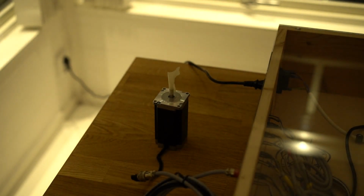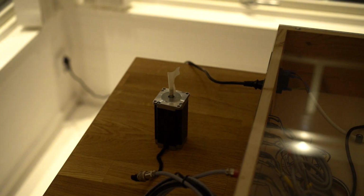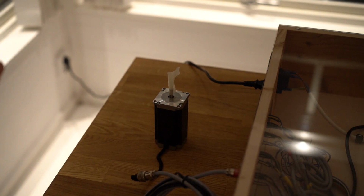This could still be because of some configuration, which I think is most likely because I keep hearing the motor when I press any of these buttons. So it is getting some current. I could try putting up the current of these stepper drivers. I think now I'm using 2.1 amps, and I could drive them with a little bit more because these motors are rated to 4 point something amps, 4.6 maybe. But first I'm probably going to look at the timing configurations a little bit.